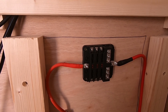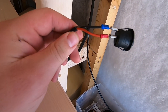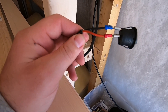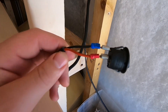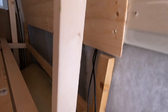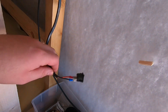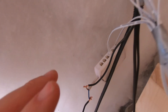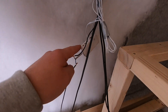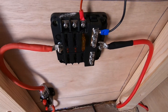Now I've wired a two-pin light switch, and the reason I'm focused on this is the last electrical video I did used a three-pin, so this is slightly different — just in case it helps you out. On the two-pin you treat them both as a live. The red live goes from the light switch all the way around into the fuse board, and the black side goes all the way around to the live of the lights. So two wires come out of the light switch: one to the fuse board, one to the live of the lights, and then the earth side of the lights goes down into the fuse board. That's as simple as that.